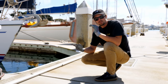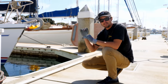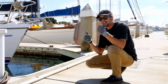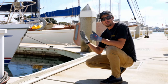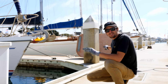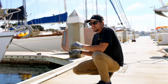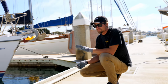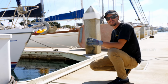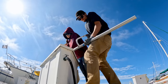I get to keep the drum nice and high off of the deck. It's gonna be at a pulpit length, so the new sail isn't gonna get even close to the new pulpit for any chafing or fouling problems, so that's an A+. It also means the drum's gonna be nice and high off the ground, so the anchor isn't gonna mess it up. There's gonna be the perfect amount of halyard length from the top of the sail out of the sheaves, and I only have to cut one foil, and I still have an extra foil too. So if I really mess up, we have an entire extra foil that we can keep in the back pocket in case we don't like what's going on.